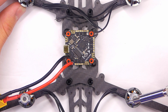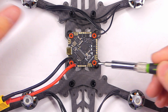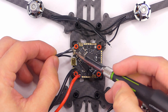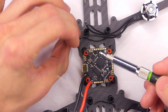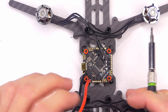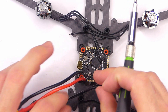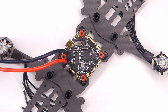Because our board is tilted, this front right motor is going to go to this connection here. The back right motor is going to go to this connection, which is much closer. Our left rear motor is going to go to this connection right next to the USB port. And our front left is going to go to this one at the very front of the board. It's a little asymmetrical but that doesn't bug me, and it will save us time not having to remap things. So I'll go ahead and tin — add solder to — all of the motor pads.